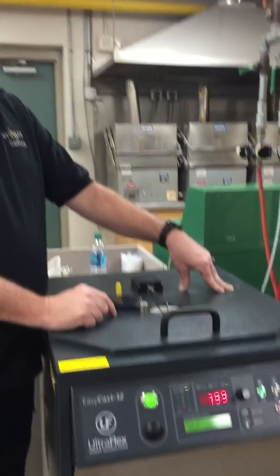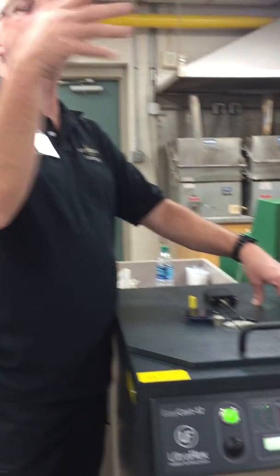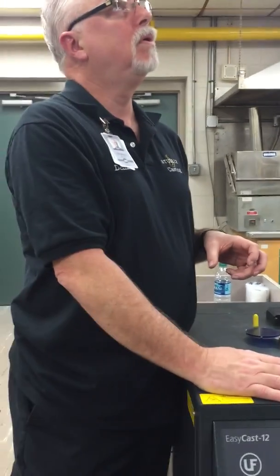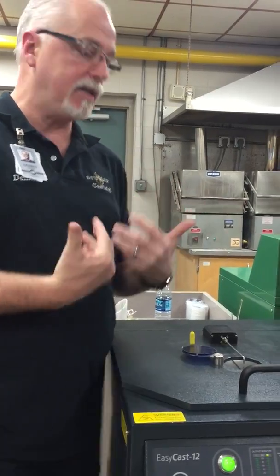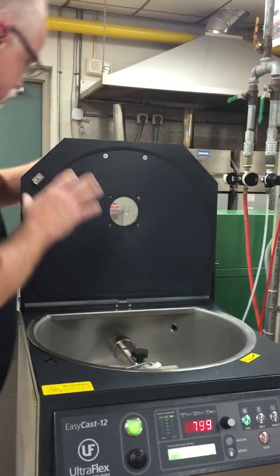Yeah, palladium will actually expand with oxygen and air. It's sucking the hydrogen out of the humidity. So it's like a sponge. Palladium's a different set of... Palladium under a vacuum reacts more readily with the silica in the crucible. So now you got cracking points because you picked that up as an alloy. So we got that warm. We don't have any moisture there.